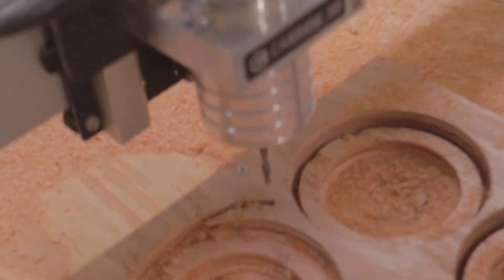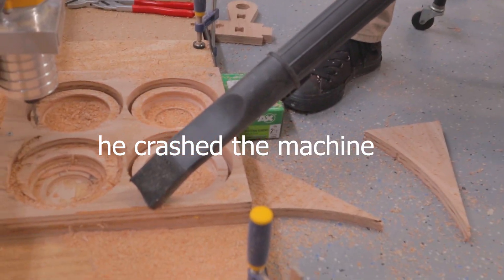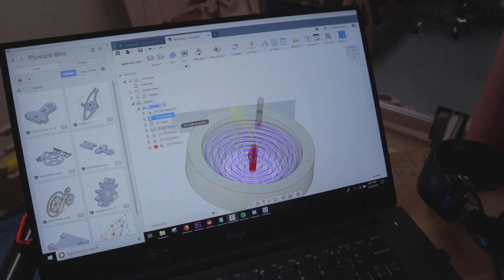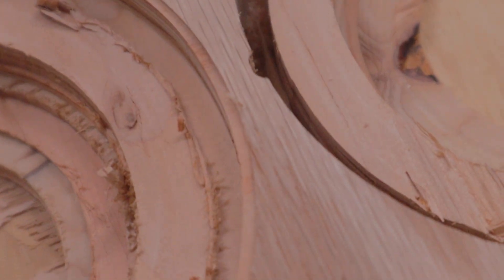Hey Morgan, you want to tell me a little bit about what you're cooking over here? I did a whoopsie — the vacuum got stuck between the tool and the work piece, it lost steps, and now we have to do this again. Instead of doing the whole cut again, we're going to skip the first big cut and only run the cuts that we need, so I've made a new cut file. You can see that cut right there — it started carving a lip that didn't exist before. When the machine crashed it shifted the work piece, so when the tool comes down even though it's in the same home position, it's misaligned.